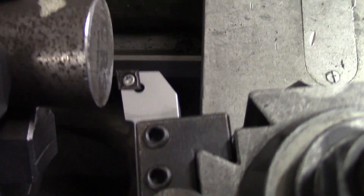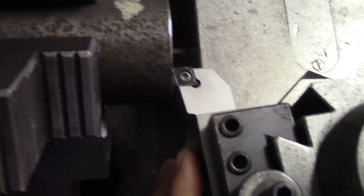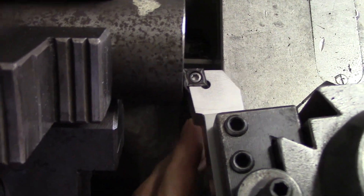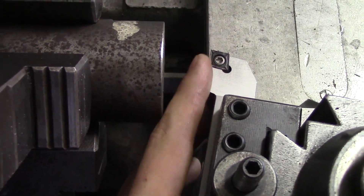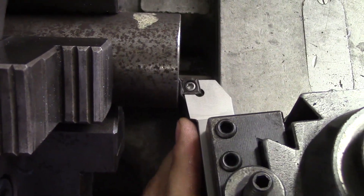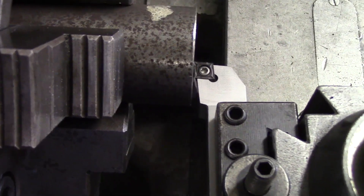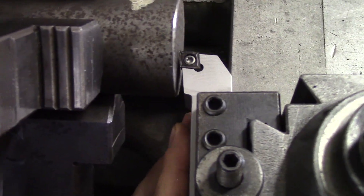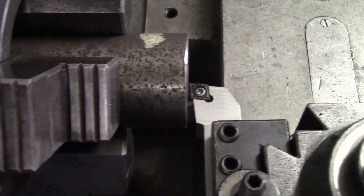When you're up against your stock, make sure you are at this kind of angle — this is kind of an exaggerated angle. You don't want to be at that angle, dragging along this face. If you're just doing a standard finish cut, you can be at a 5 to 10 degree angle — not a big deal, not something super accurate — just make sure that you're cutting with the tip.